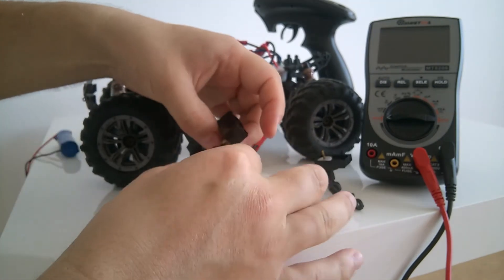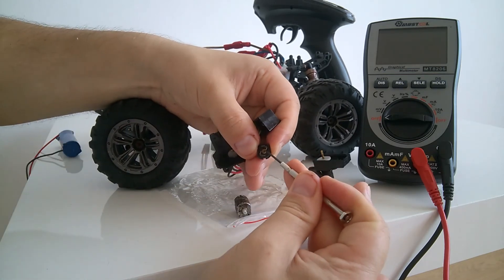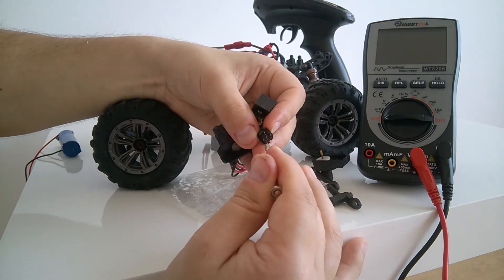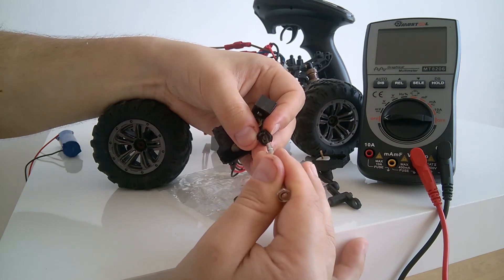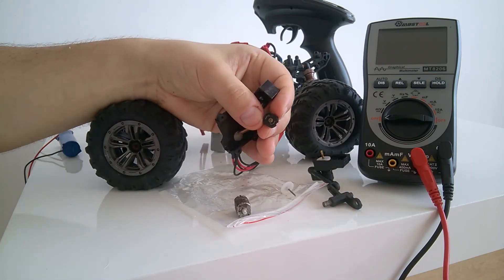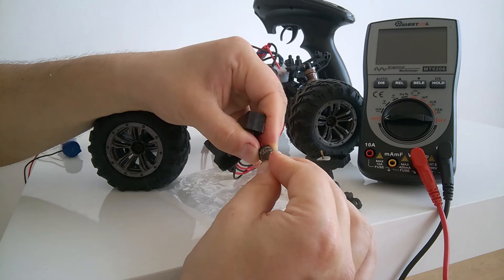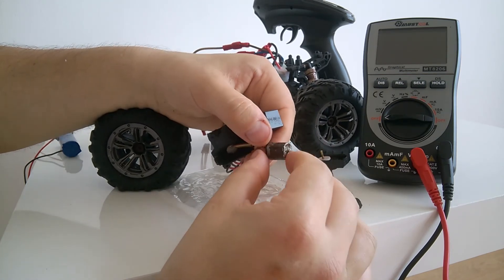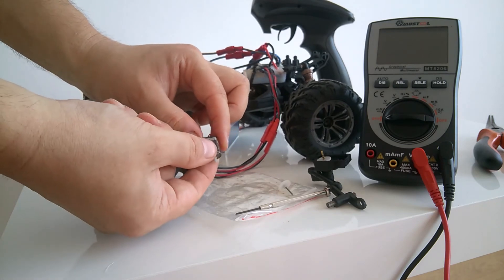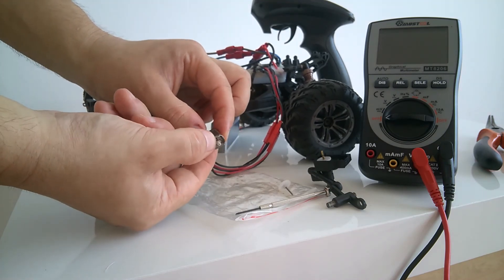Let's try to put the brushes closer to each other — maybe the distance is too big. We'll try to squeeze them and bend them a little bit closer. I actually see something falling out, kind of a paper — let's take that out. Now we are closer. We need to put this thing inside in a way that it touches the contacts without breaking them. After trying to arrange the contacts correctly at different distances and putting all the brushes in a good shape, it looks like it starts working.